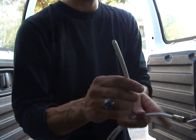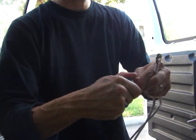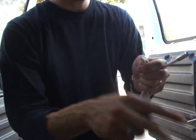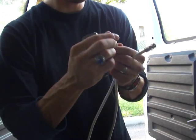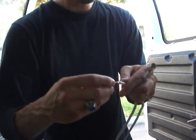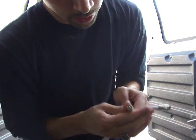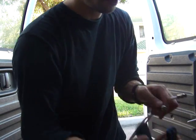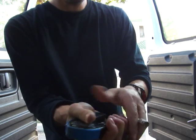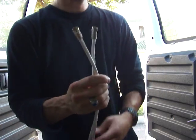Basically you do the same on the other end. Strip it, clean off the braids, make sure nothing is touching the copper prong. Push it in so the white dielectric is flush with the inner plate, trim off the excess prong, put the fitting on, and squeeze. Make sure it's clamped in, test it out — that's it. You made a 12-foot cable.